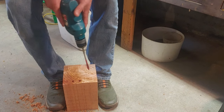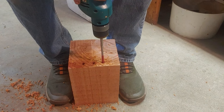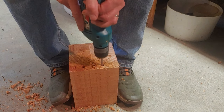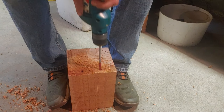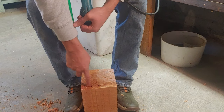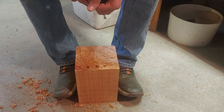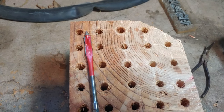We're going to try it manually and just get it lined up — the key is to keep it nice and straight. There we go, kind of works. I think what I'm going to do is get them drilled out — the wood's still real wet — let them dry for a month or two and then ream them out again. Well, I got them all drilled out but that spade bit did not work very well.